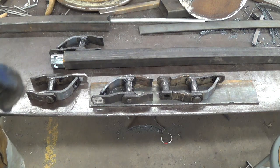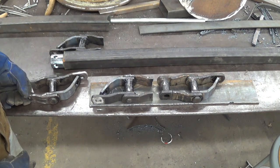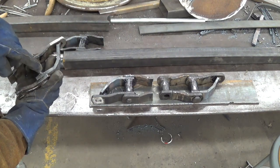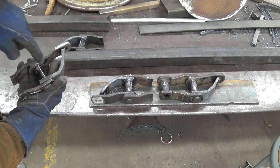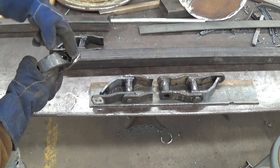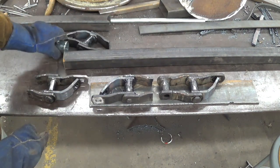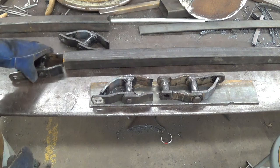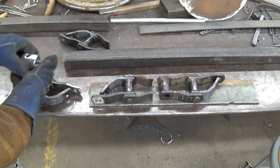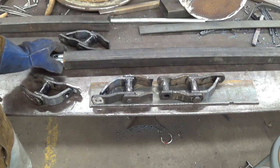Here's my outrigger system. What I did is I went to the local sawmill and got some chain links from them — big heavy chain — and I modified it. This arm here used to be the same shape as this one, but I heated it and bent it down. What I'm going to do is weld this solid here, and then I can add that into the end of the box tube here and weld this all together. At the end of my box tube, I can weld my trailer jack plug right there.